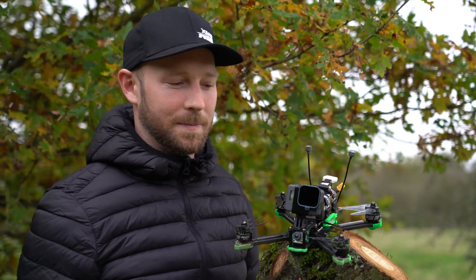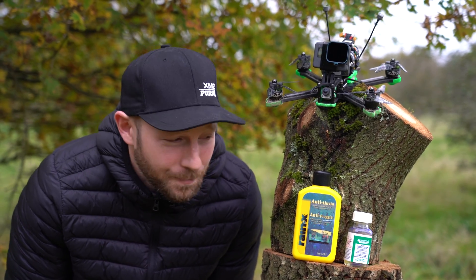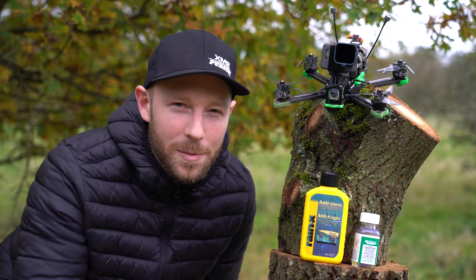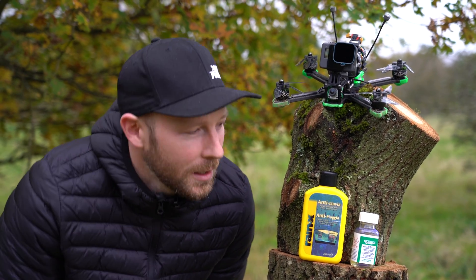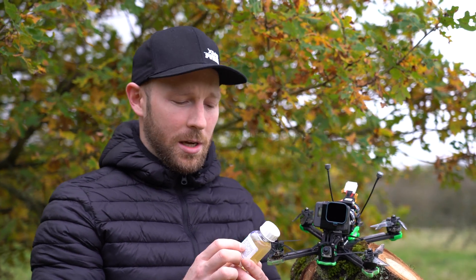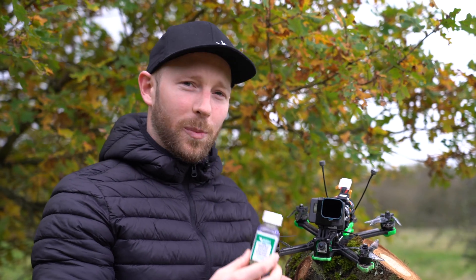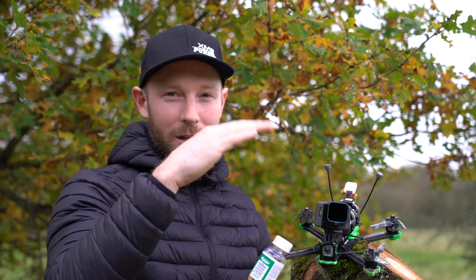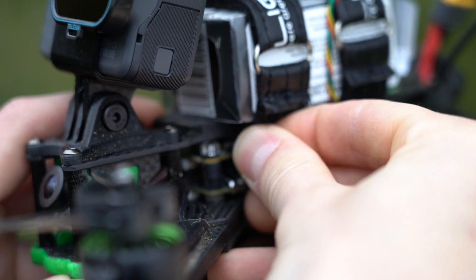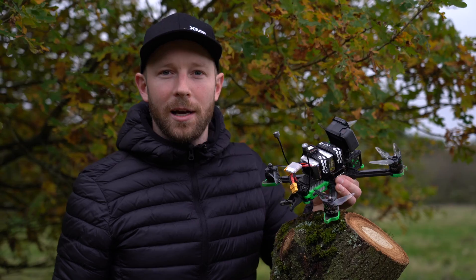Upgrade number three: you want to make your drone as water resistant as possible using two products. The first is RainX — you apply it to your FPV camera lens as a water repellent, so water flies off your lens a lot quicker. The second is conformal coating, applied to your flight controller or any electronics on board. It forms a thin layer that prevents water from causing any shorting. When applying it, remember not to apply it to your barometer, which measures altitude, or to any USB ports. I have little USB TPU printable plugs — I'll share the file in the description below — to plug off the USB ports before you apply this.